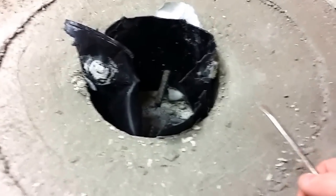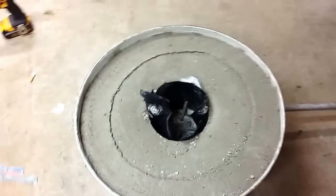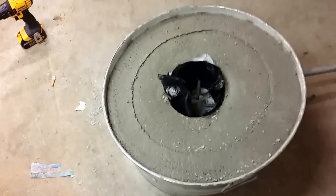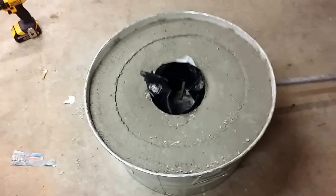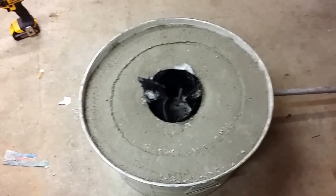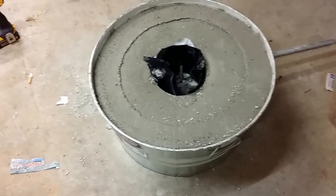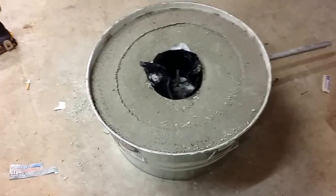The refractory material is very soft still — this clay takes a long time and you can see it dents pretty easily. This is going to take probably six to ten days to cure, and we'll also do a curing process. I'm reading mixed information about this — some people say once it's hardened to this point you can start the curing process. I'll probably wait a couple of days and let the moisture back off a little bit.